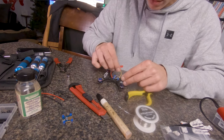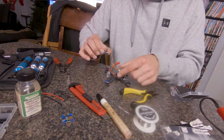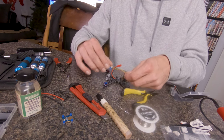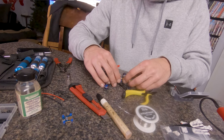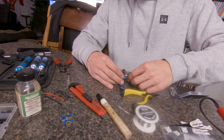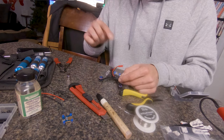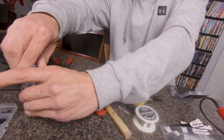Let's pull the VTX off and solder the camera on first. The camera plugs into a little plug up here and since that's the same plug that's on the cable, I'm basically just going to spool the extra slack up and tuck it behind the camera rather than shortening it. I'd rather have solid connections than a bunch of stuff soldered and heat-shrunk. I'll put a zip tie around the spooled wire and tuck it up front. After that, we'll solder the receiver on and then conformal coat the bottom of the flight controller.